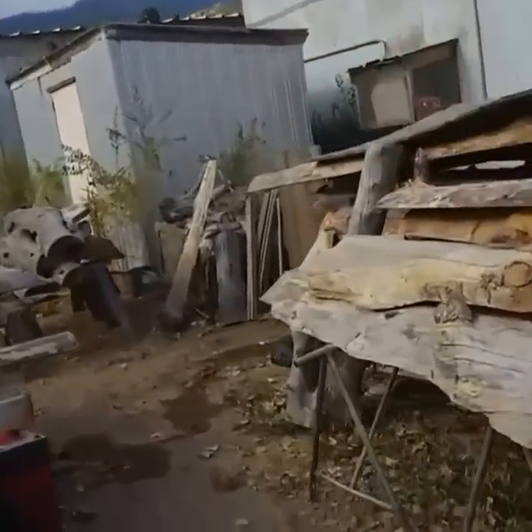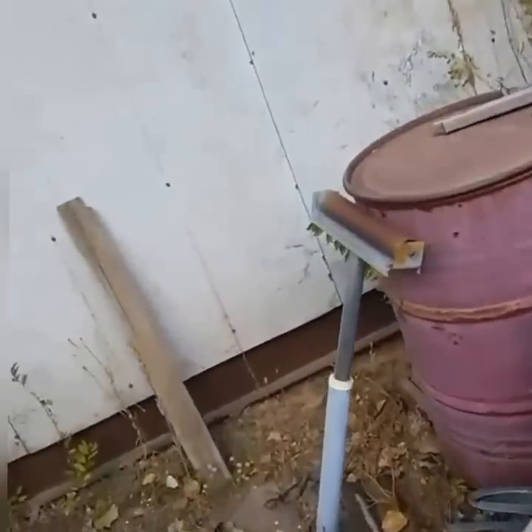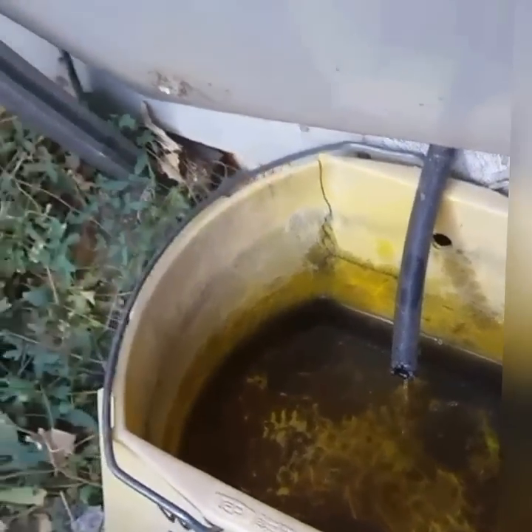Before we start filling this up, I had a question about the kiln over here — I already dumped it this morning but let's take a look. This is the backside of the building; it's got the control unit, it's where we catch the water. It runs on a heat-and-fan compressor unit in there — it's a dehumidifier basically, pumping and circulating air and sucking the moisture out, dripping it out right here. You can see mine — that thing's really running right now. We've got a mixture of green trees and dry stuff, but it'll run like this for about five days. We'll probably get about 30 gallons out of that load.